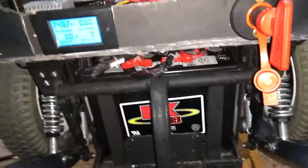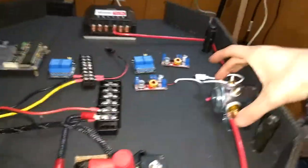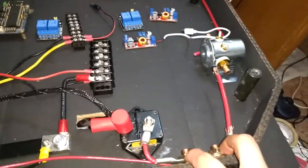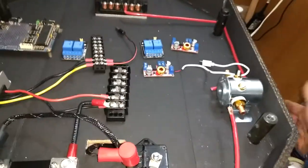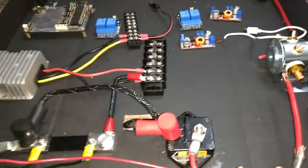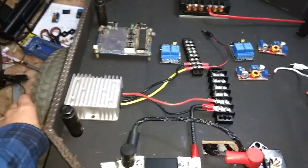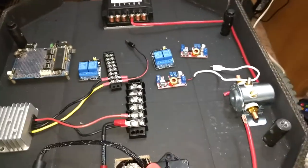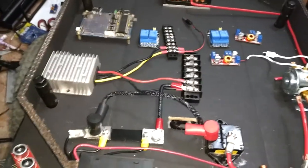These were sitting for probably three years without being charged. The key works. I'm going to need a power resistor either across here because before the contactor is powered on, it's all going to be low current, and once it's powered on it'll make the wheels movable. It's a lot of relays, but it'll be a clicky little bot. The motion and control is no different than a Roomba — a mid-wheel drive robot. That's all these power chairs are, the mid-wheel drive ones.